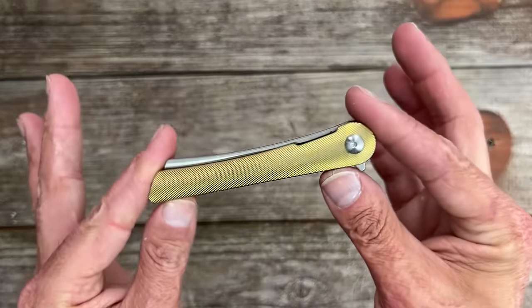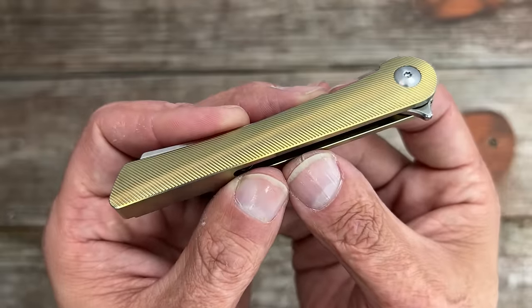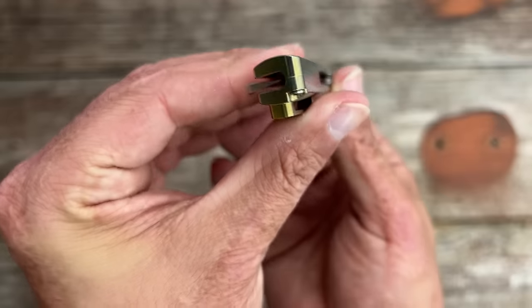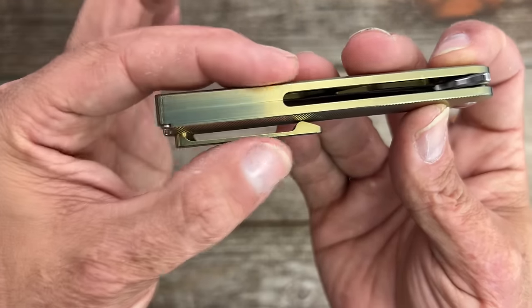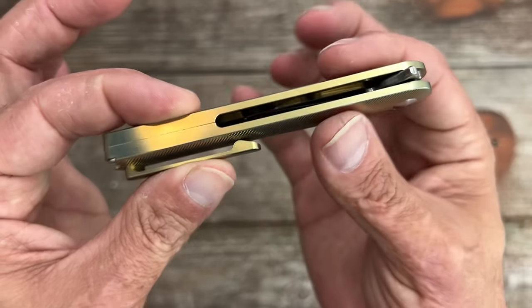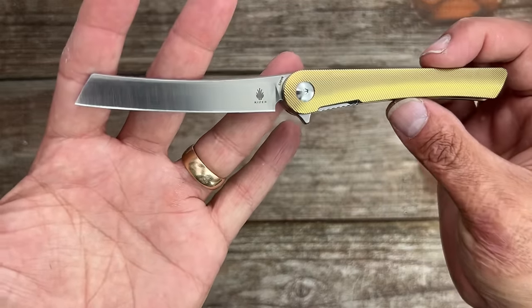Really nice. And in the left pocket, another Kizer, the Kizer Mercury. I've been enjoying this one. It's a very impressive machining feat for Kizer. At least this is the first, or one of the first of this type for them. You've got this nice contouring on the titanium with this beautiful micro milling, gold anno, clamshell construction, just meaning that instead of a backspacer, both halves meet up. It takes a lot more material, and there's tons of internal milling in there, blind screwed milled titanium pocket clip. Yeah, you have somewhat of a straight razor aesthetic right here.